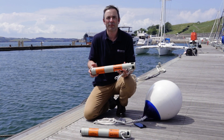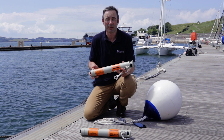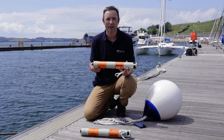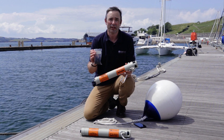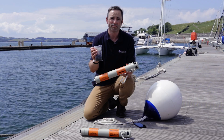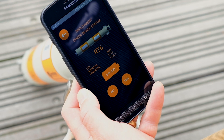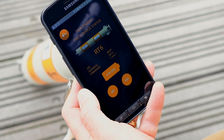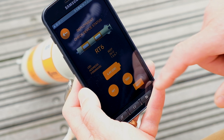Now we've connected the battery, tested the voltage, and set the address, we're almost ready to deploy the RT6-1000. The last thing we need to do is load the release nut. We've got a bag of 10 release nuts with every RT6-1000. To load this, go to the app and select Deploy. Tap Deploy and then Get — you'll be able to check that the unit ID and address are correct. Press Next, then tap Load Nut.